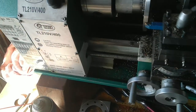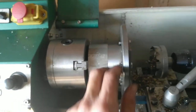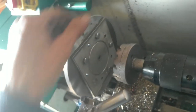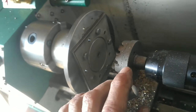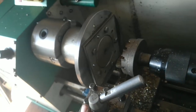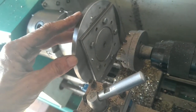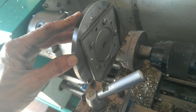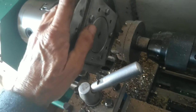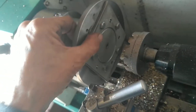What I've done here is made a jig to go on my vice, to bolt these two together. Later on when I go to finish off the reactors — the surfaces and that — I'll be able to bolt it to this jig again and that'll allow me to clean them up on the lathe. I'll be able to do a true surface grind to them.